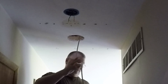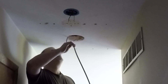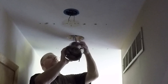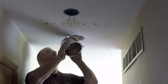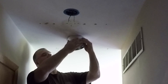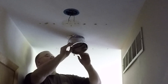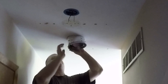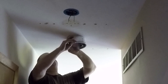There's a lot of wire here — an excessive amount. What has to be done is that wire will be capped off at the top because I have access to the attic above. I can get up there and I will use a wire clip and nail it in a couple places to keep the wire from flopping all over. There's flooring being installed up there — OSB flooring — with some extra insulation, and the wiring will sit in between the 2x4s that I'm laying down across the bottom cords of the trusses.